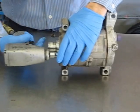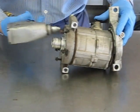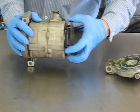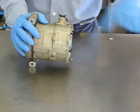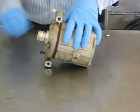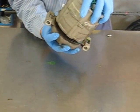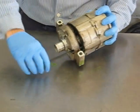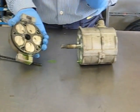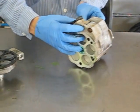We start by taking the through bolts out. The rear head will fall off. Just take your valve plates and set them aside — I wouldn't disassemble that unit yet. Take your bolts out. There are sealing washers on these bolts; you want to keep track of them. They will get hung up on the front cylinder head — we'll replace those later. The front cylinder head will drop off as well. These can only go together one way; they're all on dowel pins so we don't have to mark things.